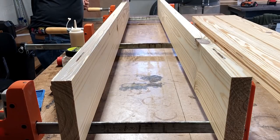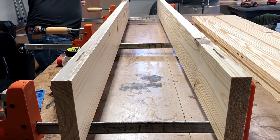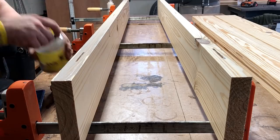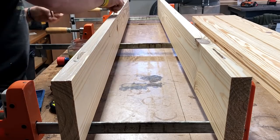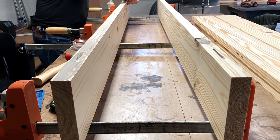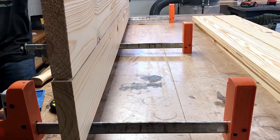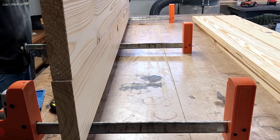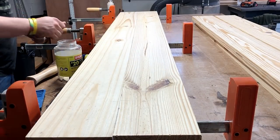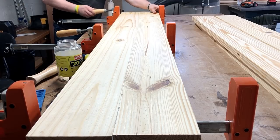The reason I do it that way is it's better not to try to do a large glue-up, because then you have a lot more chance of having boards that are uneven and not flat, no matter how well your jointing is — wood still moves. So I just do two boards at a time, and then I run those two boards after a day through the planer to get out all the glue squeeze-out and to make sure they're all perfectly even on both sides. Then for the final glue-up, there are only two glue seams, which makes it a lot easier to do the cleanup, since I cannot run that through a planer — I don't have a drum sander.